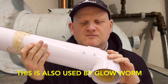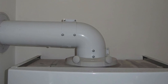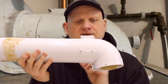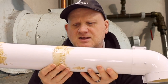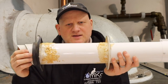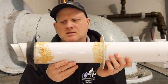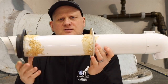The use of sand and cement to seal the chimney to the fabric of the building would satisfy both requirements. If we take this Vaillant flue, you can see they have a collar on the flue itself and a collar which secures onto the turret. There are holes here where it screws into the elbow and the turret, and these two screws will secure the elbow to the flue system via this collar. So there is no way this can be pulled out of the appliance from the outside, laterally, or from the inside. With this old Vaillant flue system in this configuration, the weather seal on the outside wall and the manufacturer's collar on the inside, with the screws securing it to the flue turret, that would be deemed appropriate — this stops rain and products of combustion coming in, and there are holes in here to secure that to the wall as well.